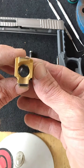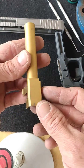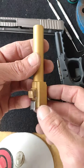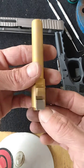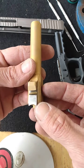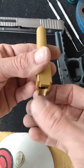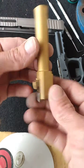Otherwise I would have just bought a new barrel. But I wanted to go over this problem because I've seen it a couple of times. It could be an issue with the locking block, but I believe it's this leg right here — this landing for the feed ramp. It was just too tall, had excess material, just wasn't taken down enough. So I took it down a bit, polished it up, made sure I got that lip off the inside. Because when you polish it flat like this, it's going to leave a burr right there, so you've got to run up in there with sandpaper and get it fixed up.